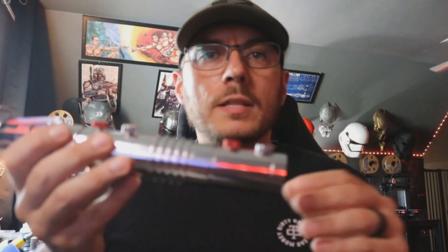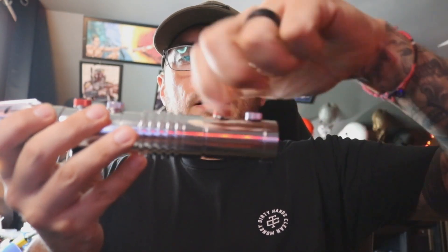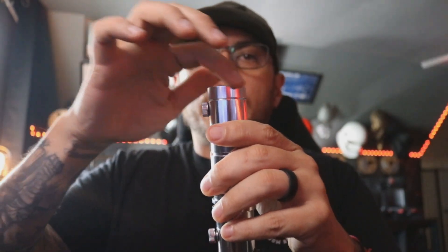There are some modifications I had to do. To get to the chassis, what you want to do is unscrew both of these. When you unscrew this one and take it off, you don't have to worry about anything — this is just kind of a chassis retention. But when you unscrew this one, you want to hold it like this because it's what's holding your emitter on.